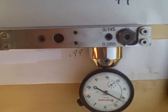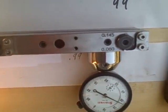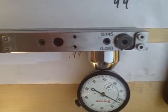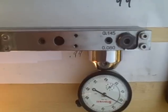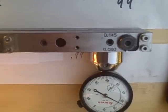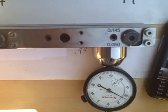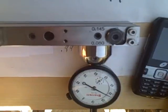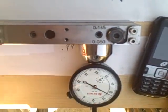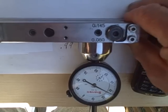These are pre-sprung so that they keep constant tension, so as you move adjustment bolts, they move for you. You don't always have to press them apart with the push screws to separate them. We have micro adjustment indicators that discern 1/2 of 1/1000th of an inch depth with each click, so it makes adjustment very, very easy and accurate.